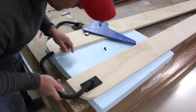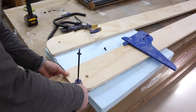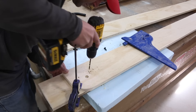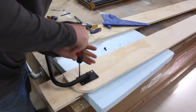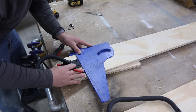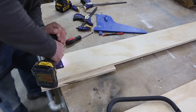Test fit the leg to check that it fits and that the peg goes in all the way. Use a square to line it up and then mark each hole location where we'll be inserting screws. Clamp the rail to a scrap board to prevent tear-out when drilling all the way through the rail, and use a quarter-inch bit to drill through the wood for the two bottom holes. Insert two T-nuts from the outer side of the rail and then screw the machine screws in from the other side. Use the block screws in the two remaining upper holes of the bracket plate. Repeat the same process on the other side rail. The legs will eventually be connected to each other with a rail and will help ensure that the bed sits level.